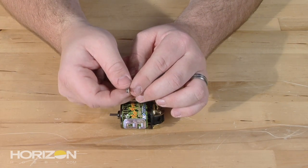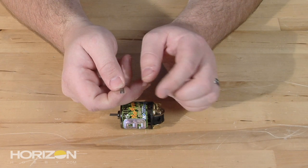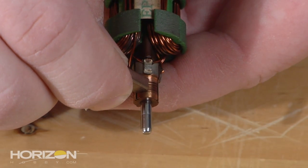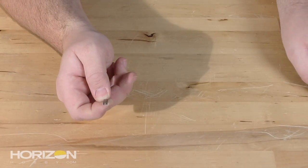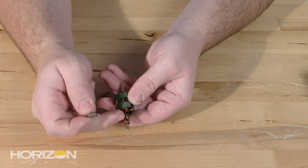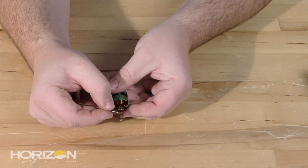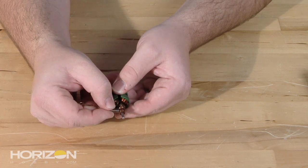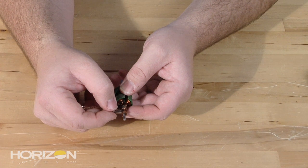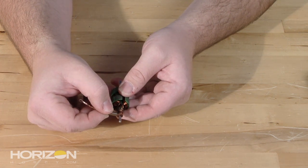You can alter the performance of the brush by drilling holes in it or slicing them up. There are a couple of different brush configurations. There's what's called a stand-up brush — basically taller than it is wide. Some motor manufacturers, primarily in 19-turn and 27-turn stock motors, have also gone to a lay-down configuration — the same physical brush size but wider than it is tall. As the brush spins around the commutator, it transitions through each slot on the commutator — think of them as an on-off switch. With a lay-down brush you get more overlap between two segments simultaneously, and many manufacturers have found this increased overlap produces more power.